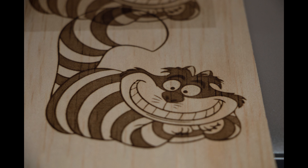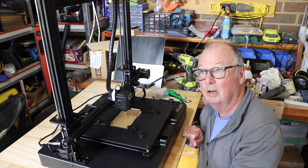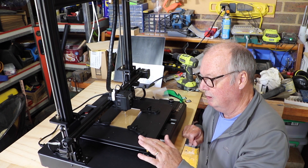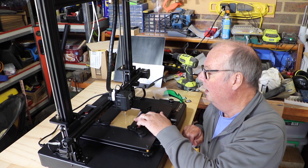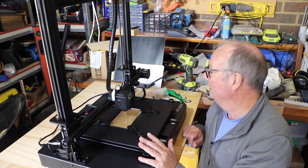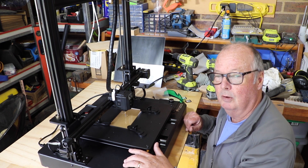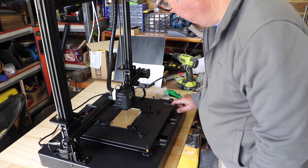Okay, that's it for the laser, now we're moving straight on into the CNC. I'm out here in the garage so the lighting's not real brilliant nor the audio, so bear with me. I've changed out the tool head to the CNC tool head, taken the heated bed off, and put the CNC metal plate on with the hold downs. I have the piece of perspex that came with the machine and the SD card with the test file. There's no auto leveling for the CNC part, so it's important to get the gantry level with the frame and the bed because you're only looking at a 0.2 engraving depth. Let's get started — I think this is going to be loud. I've selected CNC carving test, let's go.